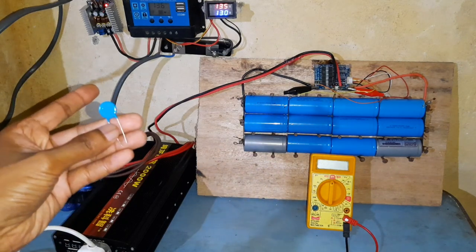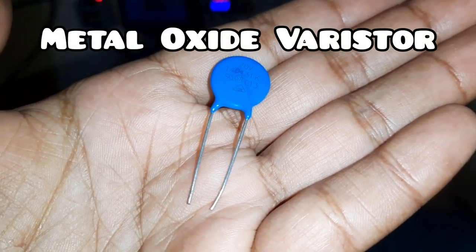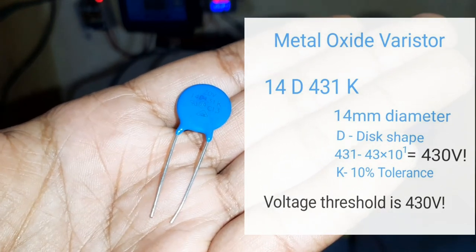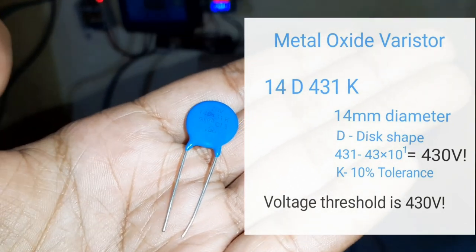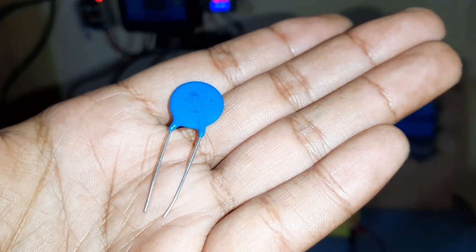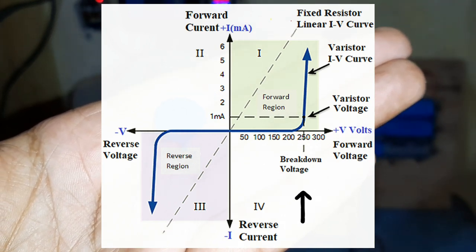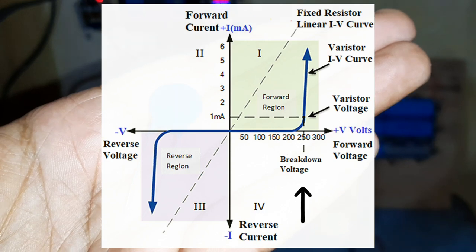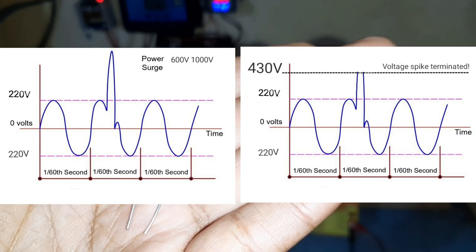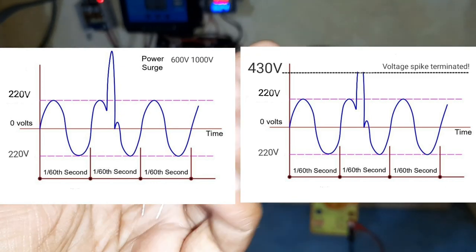So now let's come to our little device here. This device is called a metal oxide varistor, or MOV. Its number shows 14D431K, which means its cutoff voltage is 430 volts. Below this threshold voltage it has very high resistance, but once it reaches the threshold voltage its resistance drops dramatically, and that allows the voltage spike to discharge, effectively cutting the voltage spike at 430 volts. These have very quick reaction times and immediately return to high resistance values when the voltage is back below the threshold.